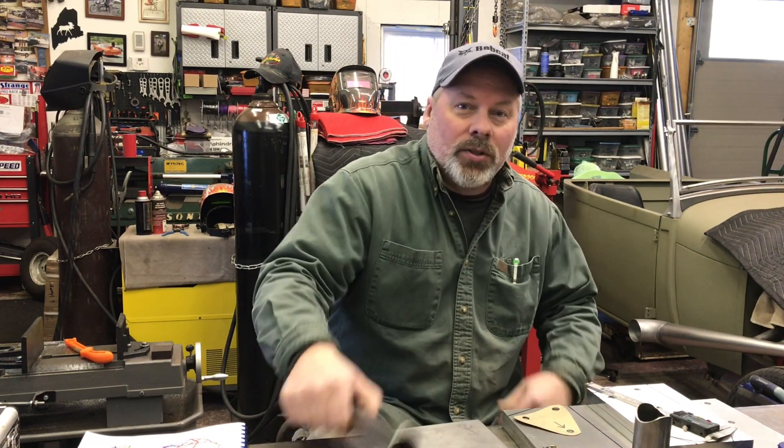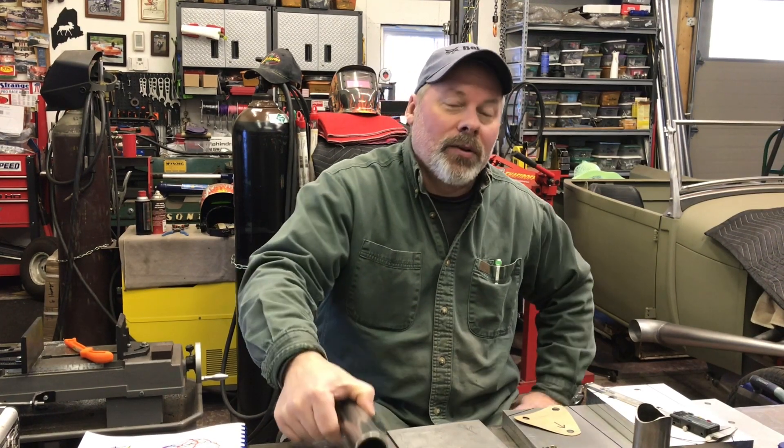The most economical way to build a roll cage or chassis is to buy the tubing in 20 to 22 foot sections and bend it yourself. I have an Affordable Bender — three to four hundred dollars — and it does a good job. It actually kinks the tubing less than the pre-bent ones do. There are nice hydraulic benders available too, and this gives you the freedom to really make it fit nice. If you make mistakes, you've got lengths of tubing — just grab another piece and try to use the piece you ruined elsewhere.